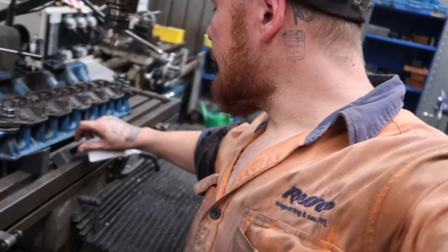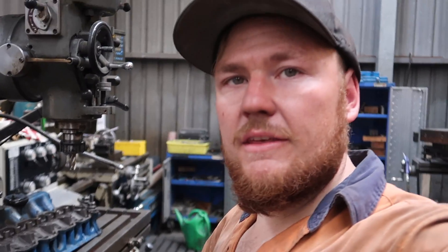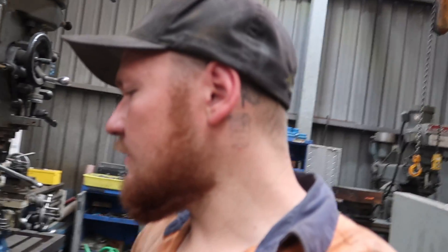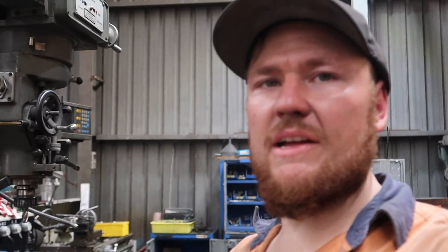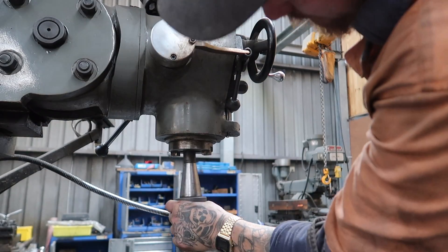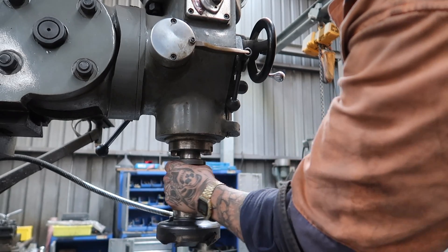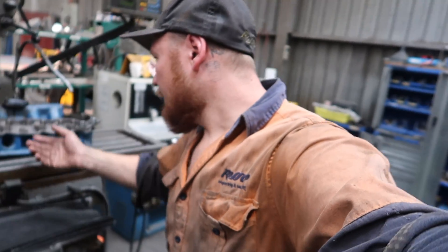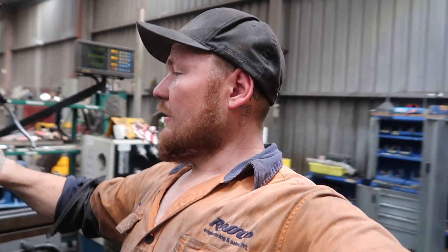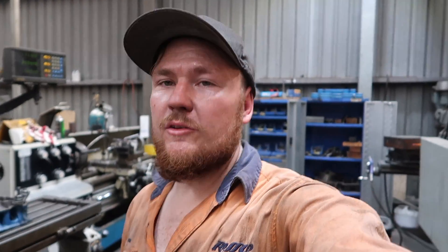I've got it within about 0.4 of a mil with these things here, but the increments go in one or two mil increments, so that's as good as we're going to get. I'm just going to play around and maybe put a paper shim underneath it to get that last bit. I've got the arbor in and lifted it up - you can probably see it's unleveled. I've mucked up something, or when I did it up it moved a bit, so I'm just going to redo that and start again.